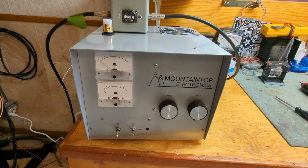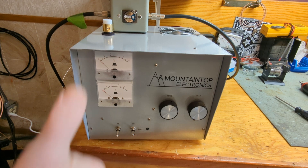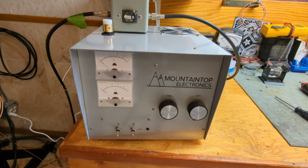This box really gets up with a lot less drive because it's a little higher on the voltage. When it comes to 500 Z's, these things run really well anywhere between 3,000 to 4,000 volts. I'm very happy with these Penta Laboratories tubes — I have no issue running them at 4 kV. I've had a couple of boxes right around 3,900; this one is around 3,850. Don't be afraid of using higher volts — you can use less drive. The tubes are happy. Those Penta Lab tubes are great. Listen to how quiet this box is — you're going to hear the step start, see the voltage come up, and hear how quiet the blower is. You can put it right on your desk.